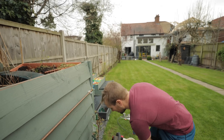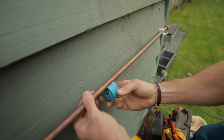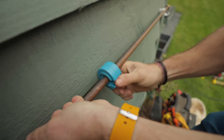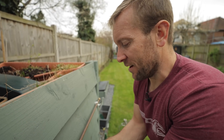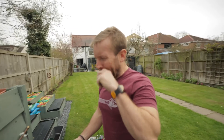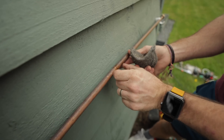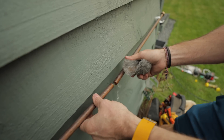The good thing about a pinhole failure is you can cut straight over the piece that's failed — line up your cutters right on the middle of it and cut straight through. Imagine the days when you didn't have pipe slices to cut pipes and had to use a hacksaw for everything. There are two ways you can now effect a fix: you could put on a straight compression coupling either side, but we're going to put on a solder one, so we need to make sure there's no water left in the pipe at all.